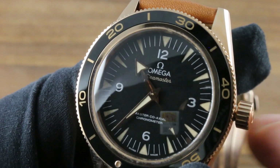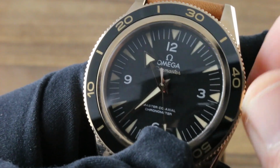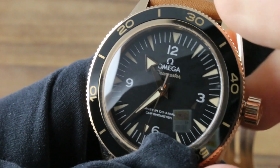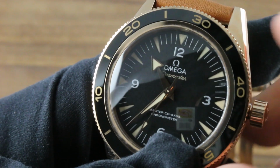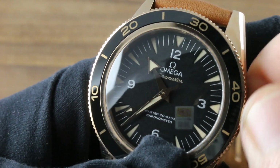If you wish to wind the watch all the way up to its maximum rated power reserve of 60 hours, simply continue turning the crown. 80 to 100 turns will be sufficient to fully energize the watch, and you cannot accidentally overwind this timepiece as there is a bridle style mainspring that slips to relieve excess tension.